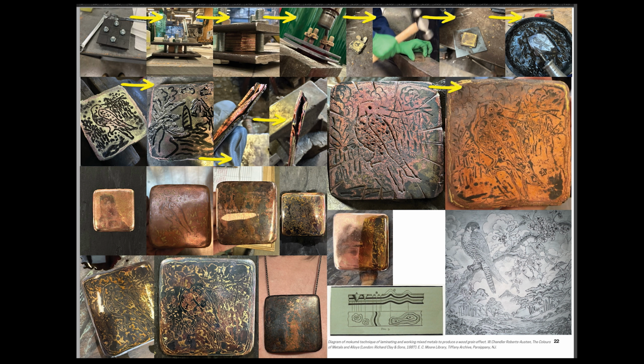So in January, February, with moving closer to uni to have access to the hearth and the metal workshops, I undertook my largest scale Mokume to date, and I used tooling which I created, which is these mild steel plates and these screws to add uniform pressure to the billet while I was forging it.